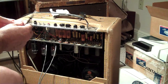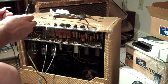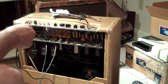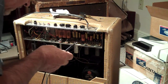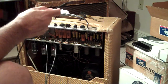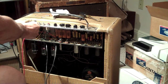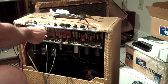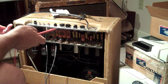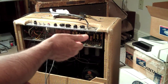Actually, you need to go off the 25-watt section, which is for the EL34s — they don't actually list 5881s in those tables. Either way, here's my meter, cheap old Radio Shack. You would ground one probe and touch the other to the main wire that comes off the power transformer onto the power tube socket, which is pin 3, and you can check your plate voltage.